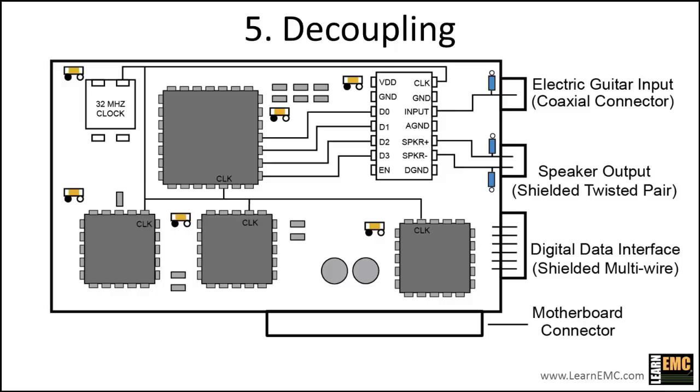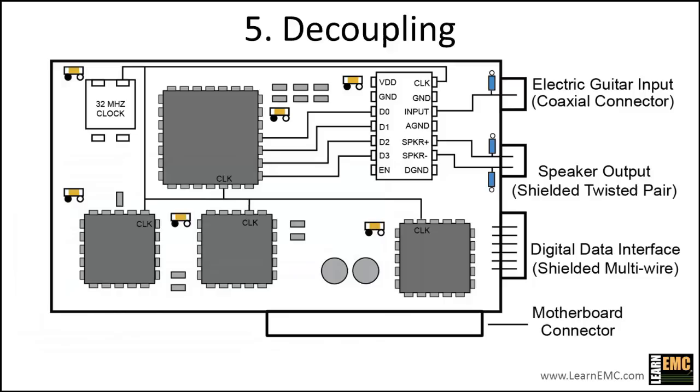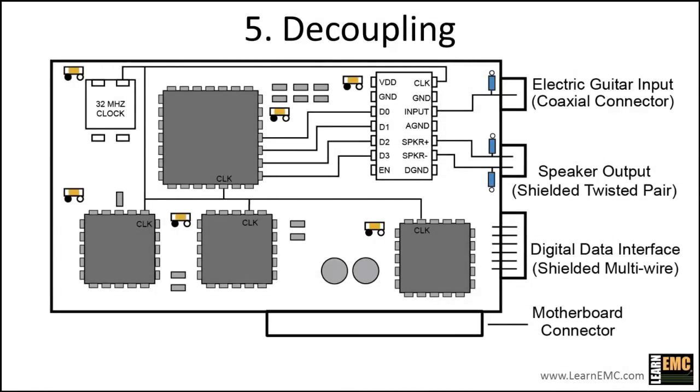Now let's take a close look at the decoupling on this board. The power and ground planes are on closely spaced adjacent layers, so all of the decoupling is global. This means we don't need to worry about placing capacitors very close to active devices — we can scatter them around the board. The existing decoupling capacitors are scattered around the board and connected directly to the planes using vias in the pads, just as they should be. The vias are located very close together on one side of each capacitor, which is optimum for global decoupling. The decoupling is done exactly right with just one exception: there are not quite enough capacitors. One capacitor per active device is generally not sufficient on high-speed boards where active devices may have multiple power pins. We'll add more global decoupling capacitors in the new layout.